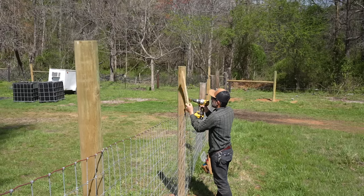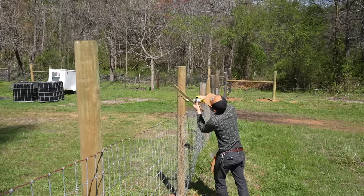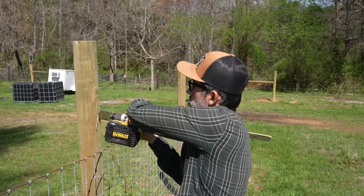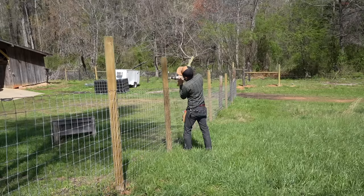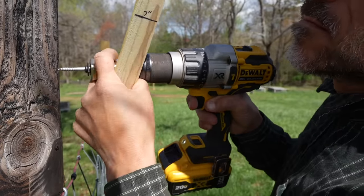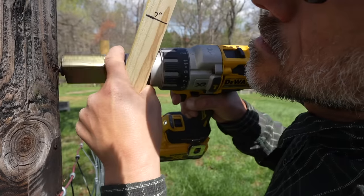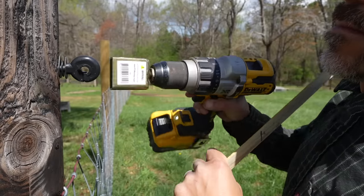Keep in mind that this line is going to be hot — it's going to be energized. I've seen some other farms where instead of it being energized, they might put barbed wire, something so the steers can't look over and eventually bend or ruin your fence. But also, I want to be able to tie into this hot wire so I can tie that into some of our nettings that we use.